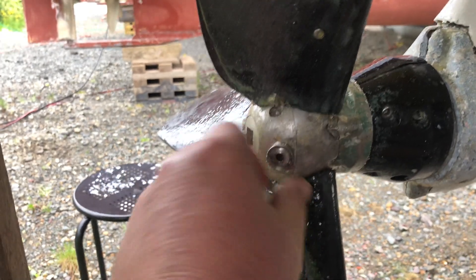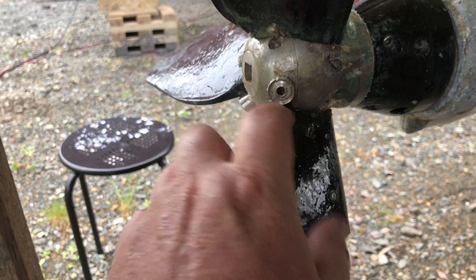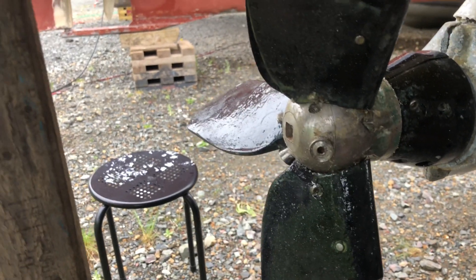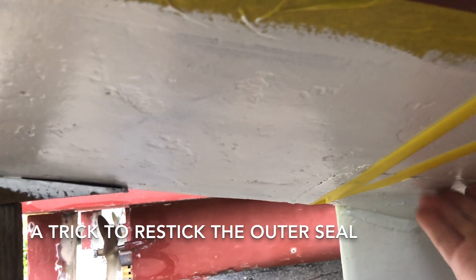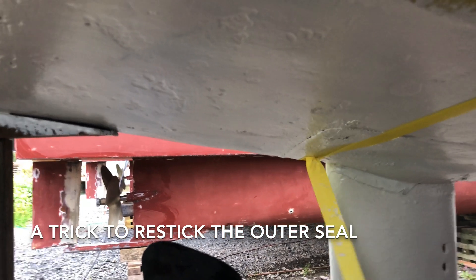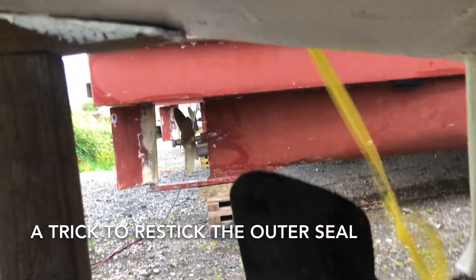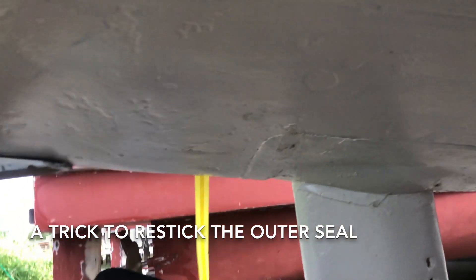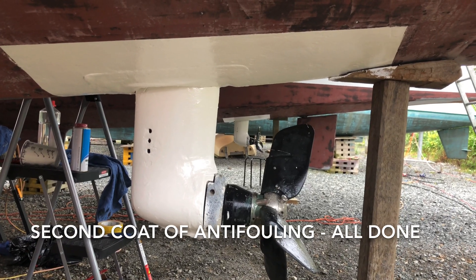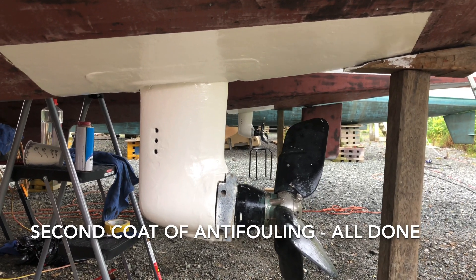I've freed up the rollers — they run on the back of the blades here. Newer ones apparently have rubber caps and are greased; these ones don't. I have trouble with the rubber diaphragm coming loose, so anti-fouling paint under it and stick it up with tape — and lo and behold it should be stuck there, just like that. Both props are on. Second coat of anti-fouling, tape off — this is the port side, starting inside through there.